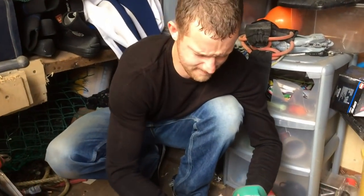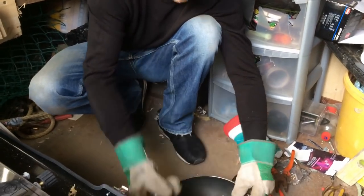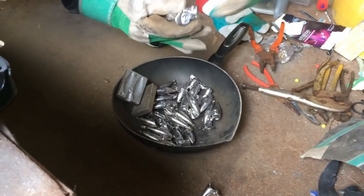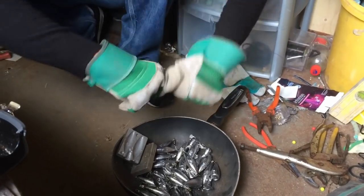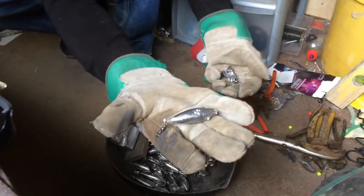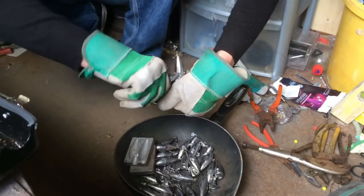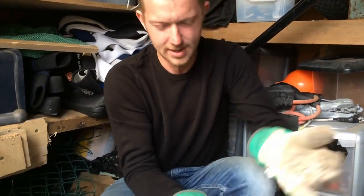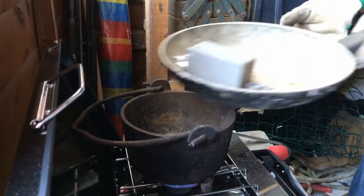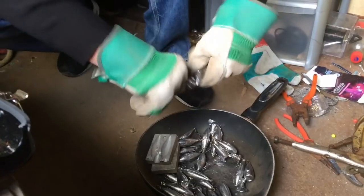For the clean-up of these leads, it's good to do this while they're still hot. There are bits like this on the leads — put them all to one side. Just where the overfill is, you can either snap them off or cut them off. There you go — perfect leads. This lot is pure lead, all the dross has been taken out. Get all the excess straight back in the lead mix because it will melt a lot quicker than the cold lead.